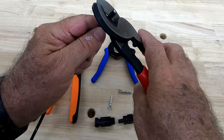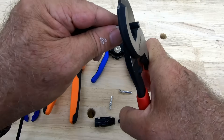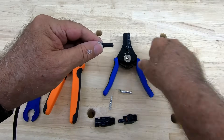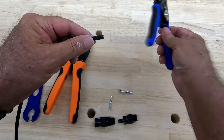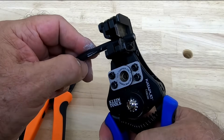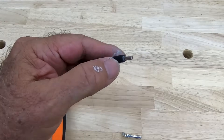What I use on this is my cable cutters. You want to take off about a quarter of an inch to a half inch on there — what you're doing is you're just scoring that. You can do it with a knife also, but it's just kind of easier this way. Then I set this in the largest one here — that does it automatically for me, so that way you get a nice, nice groove and you're not getting any frayed ones.